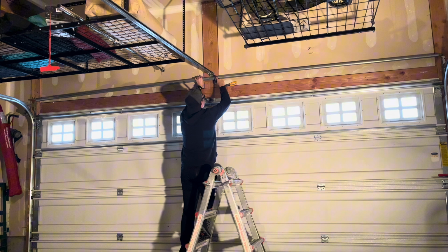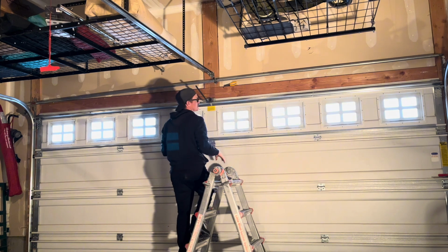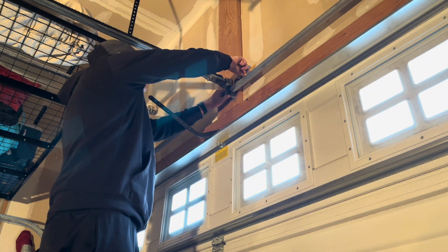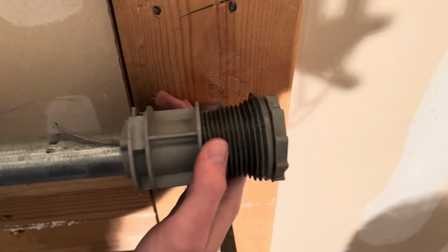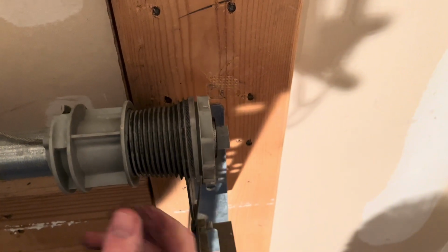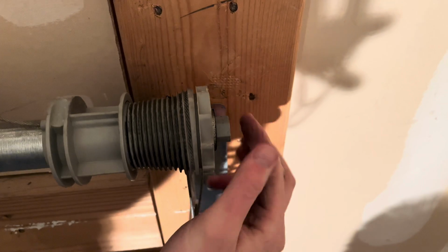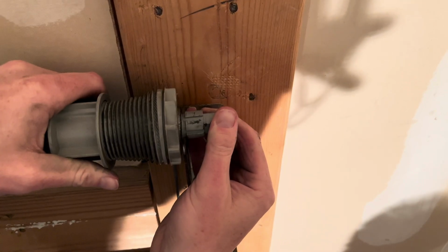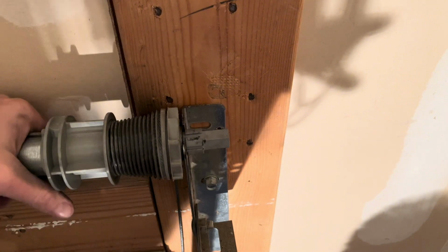And with the center point here, you should be able to just slide that right back over, and then you can come over to the edges and finish that up. And while I'm here, I'm going to flip that little tab back over. Next, you're going to slide your winder drum back on. Again, that can only go on in one direction as the teardrop shape will allow. And that only goes on so far. And then you've got that little groove there. You're going to want to make sure that that groove sits in there like that.